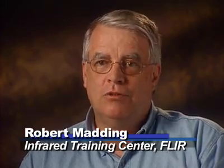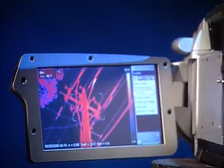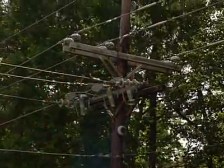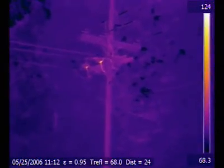When we are teaching about the P640, it has a 640x480 resolution, which means it has 307,000 plus pixels. For the user, that means with the same field of view, you have a lot more resolution. The FLIR P640 has a sharp, crisp image. I'm getting better accuracy in my Delta temperature. It helps me analyze my equipment better. I can tell exactly where the problem is, and it cuts down on time. You'll be able to see things faster because you can see things clearer.